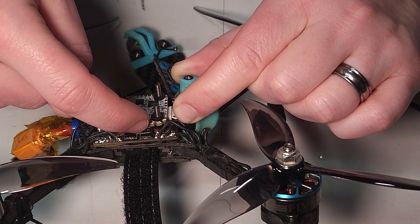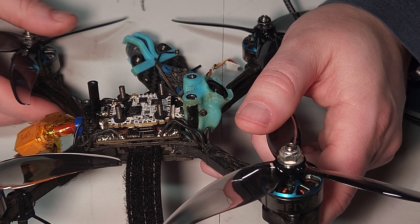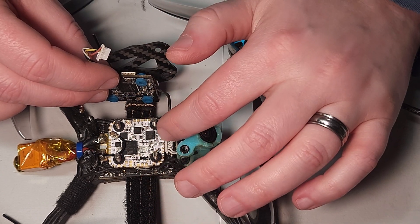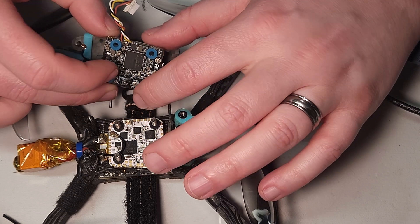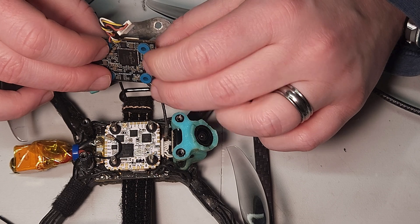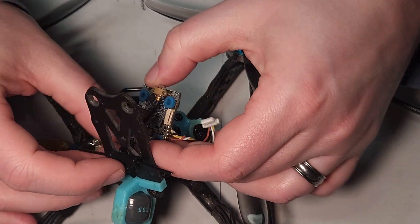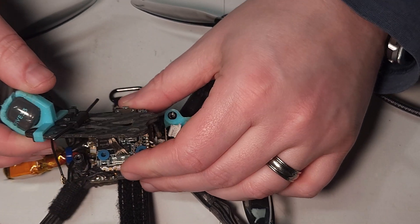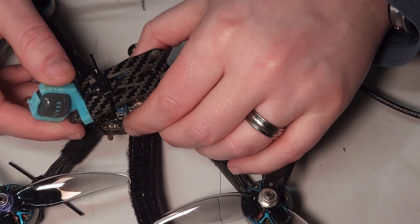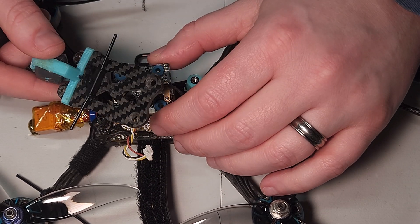You want the USB port facing down. There's a bit of Kapton tape applied to the bottom to provide some insulation against shorts. You can use thinner gummies on your Race V3 with this flight controller because all parts on the top are very low profile. You can rotate the VTX 180 degrees and put it down, or rotate it 90 degrees if you need a pretty good low profile stack without anything touching. The key is to keep all your tall parts on the bottom side of this flight controller so that when you stack the Race V3 on it, it doesn't have anything to run into.